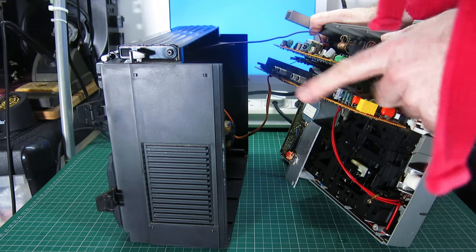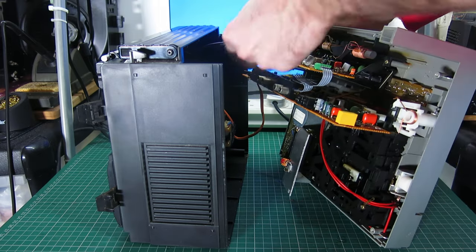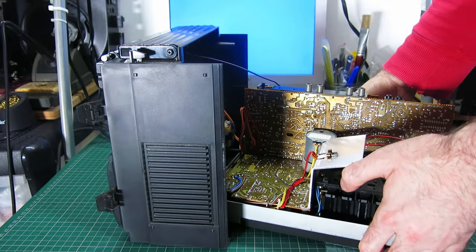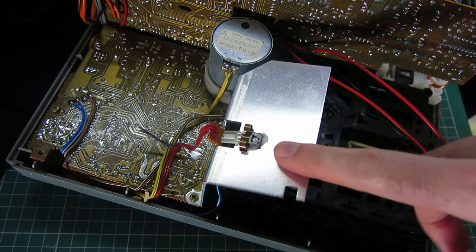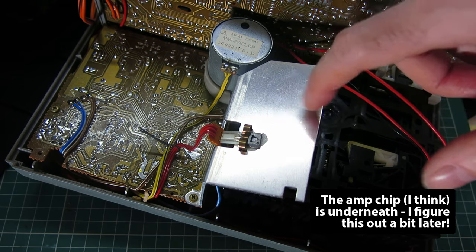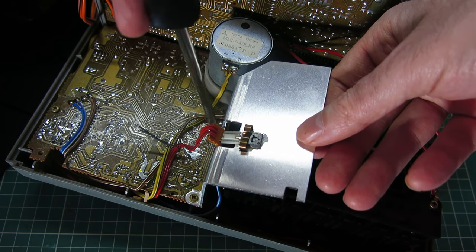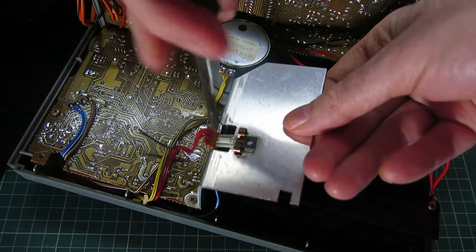This big plastic block here is all we see from the back of the tape transport. There's another October 1984 moulding mark on the front panel. So we've got a tuner board, an amp and mixer board, and the front panel down there for the graphic EQ. It's frustrating that the antenna wire just solders into the top of a switch. There is enough slack on it to lay it down, though it's going to have to be like that the entire time. This big heatsink and shield just has a transistor — probably a power transistor or regulator. It's not the amplifier because it's only a three-pin package.